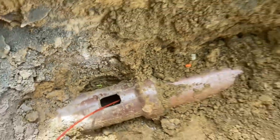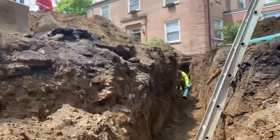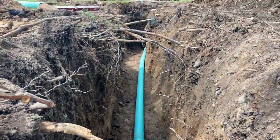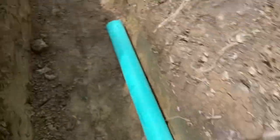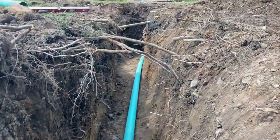This isn't copper — that's why you've got to put a snake down there and follow up with a metal snake. Sometimes it's so blocked you can't get past it. Pipe is going in. Adding our second cleanout. You guys are going to cut the clay main. We can add our clay-by-plastic fernco. We're rocking and rolling.